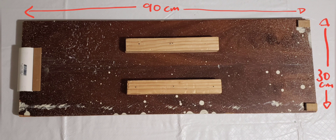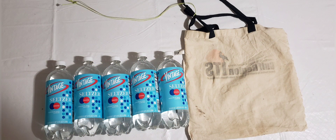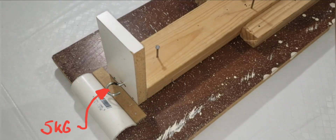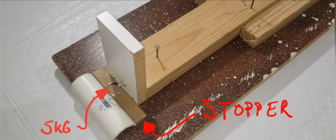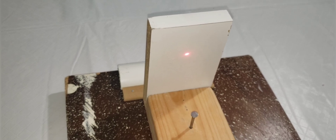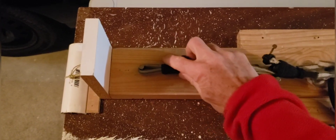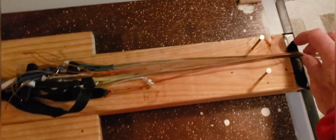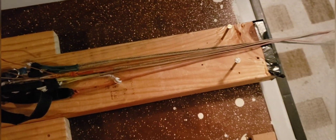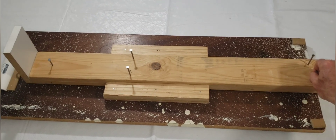This is the slider base with guidance for the moving part, and a plastic tube to reduce friction when pulling up 5kg. For the 5kg, I take five 1-litre bottles in a bag, hooked up to the sliding part. Also notice the piece of wood to stop the sliding part. The sliding part has a white plate that will be the shooting target for the laser. The upper nail is to hang one riser at a time, and the other set of nails are to keep the lines and riser together. Some tape at the edge avoids friction for the lines in case they touch the wood.